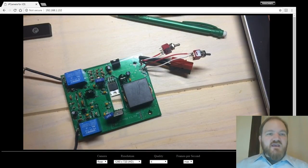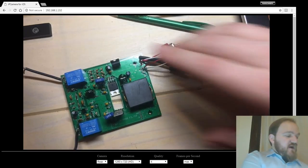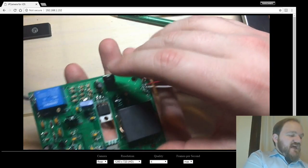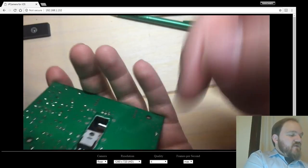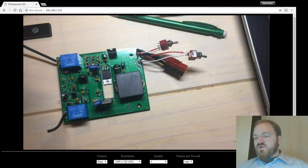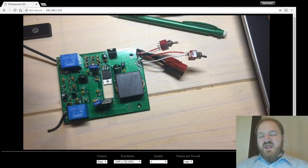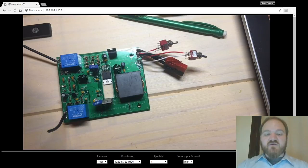We are going to make a parameter for, so like I said, I'm going to make this box, which will have little standoffs coming up from the bottom of the box to meet up with these holes. And then we're going to do knurled inserts going into them. So for an M3 screw, my standard hole size in PLA for a 3 millimeter threaded knurled insert is 3.4 millimeters in diameter.